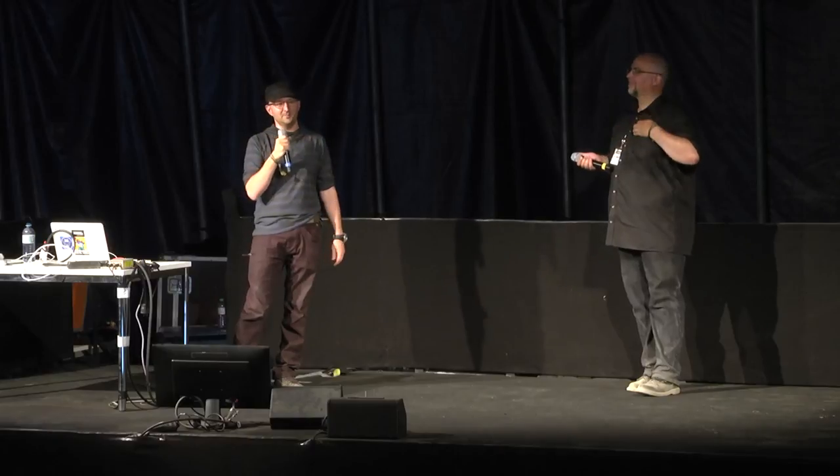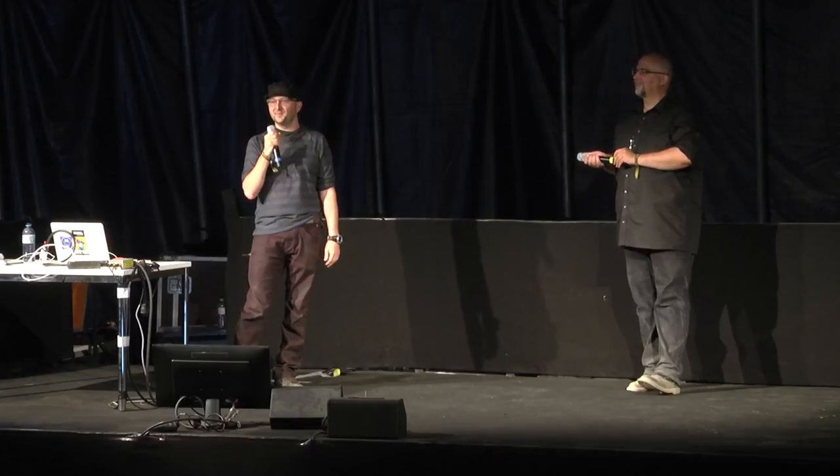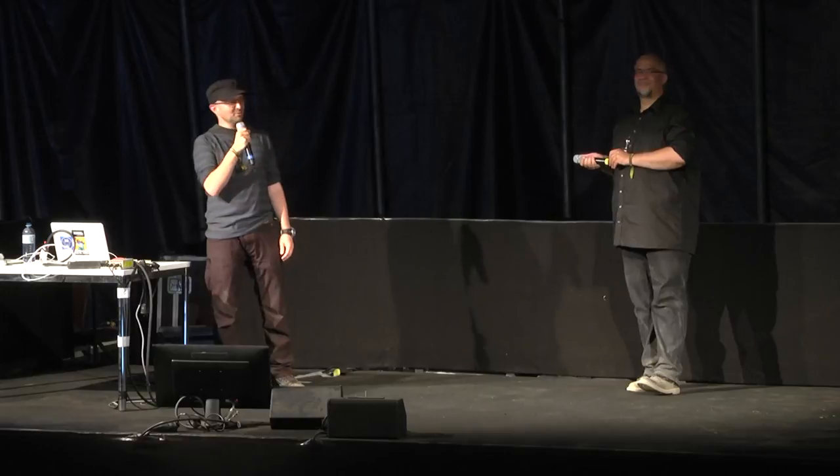A friend of mine has built a very large one. This one's a 50 kilowatt coil, and I go sit in the toroid when it runs, right on the high voltage wire. So I sit at about a million volts, and you are down there at some strange negative voltage from my point of view, but I think I'm at zero. And that's kind of fun because you can poke objects out through the toroid and you can throw lightning bolts at people, which is fun to make them scream and run away.